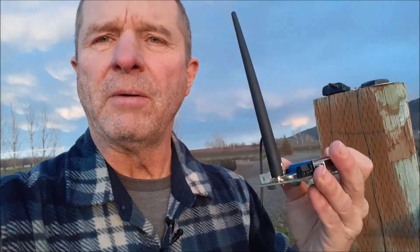When you set up a base station, you're essentially determining a known location to use as a reference point. You can do that by contacting a surveyor, or there are other ways to determine specific locations down to less than an inch of accuracy. The RTK board I'm using is the same board I have inside the vehicle — they are identical. The only difference is one is used as a mobile rover unit and this one is used as the base station.